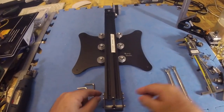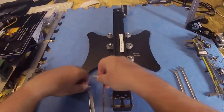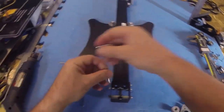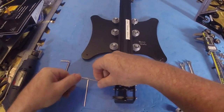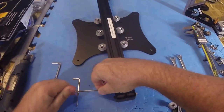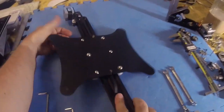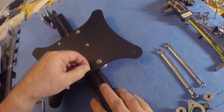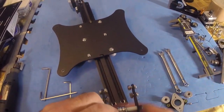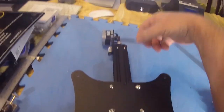Let's see how fast we can do this. I know that I need to loosen these up because I want to take the belt off. Once I get these loose, I'll be able to remove the belt from this part here. Once the belt is loose, flip your assembly over, twist it a little bit and pull it off. Now the belt's done and can actually be removed at this point if you want. I'm going to go ahead and remove this side of the belt so I don't damage anything.